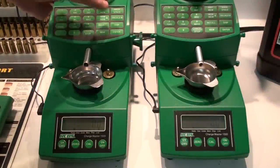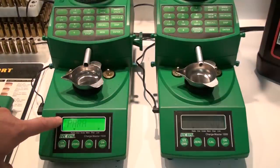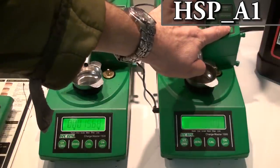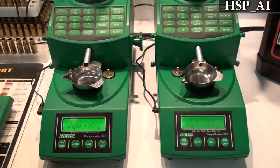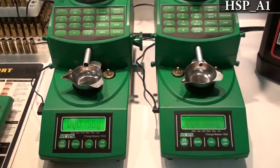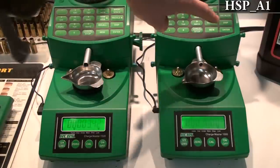To get into programming mode on the Chargemaster, you're going to need to press the ENTER and the EDIT MEM button at the same time. It'll blink and tell you 'adjust parameters.' The first parameter is HSP_A1. I'm going to punch in our reprogrammed Chargemaster so you can see both parameters at the same time. HSP_A1 is the number of grains underneath the target charge weight at which it will run from full speed and change down to high-speed trickle. It's set at 15.68 on the new Chargemaster. I've got mine set to 10.00, so I'm going to reprogram this one to 10.00 and hit enter. That'll move us to the next value.